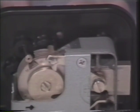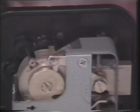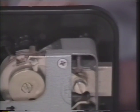Then we insert the probe that comes with the kit. The probe has an eccentric tip, which we rest on the furthest wheel pack and then dial it. As the slot comes around, the tip drops into the wheel pack. You record this number. Now this sequence is then repeated with the correct dialing sequence for every wheel pack. You'll feel the tip drop in as the slot comes around 3 times, and you have a series of 3 numbers. Now, this is quite easy to feel.